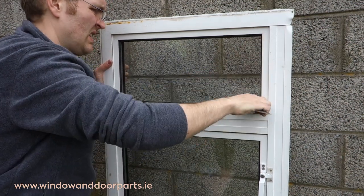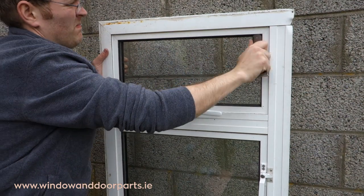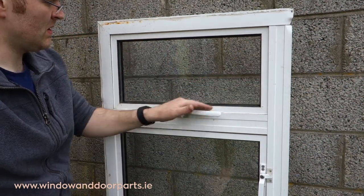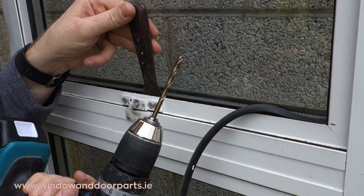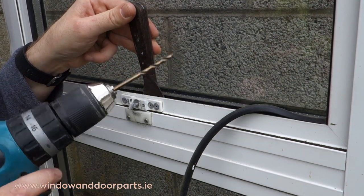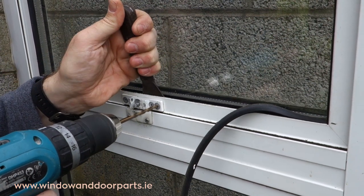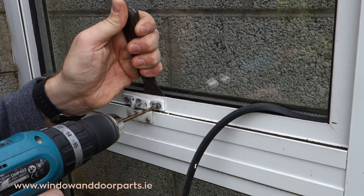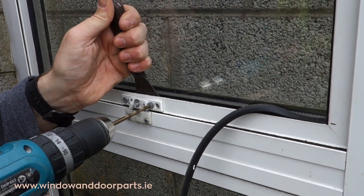So that's how you remove and refit the glazing, and I would definitely recommend removing the glazing if you have any doubt about the space you have. This is the process of replacing the cockspur window handle. Use a paint scraper and put it in the gap behind the handle — this will protect the glazing as you drill off the rivets. Next, fit a 5mm metal drill bit into your drill and carefully drill the heads off the rivets.